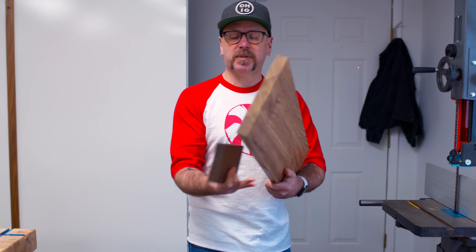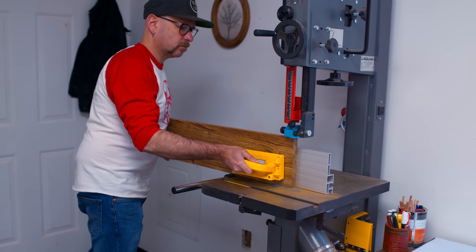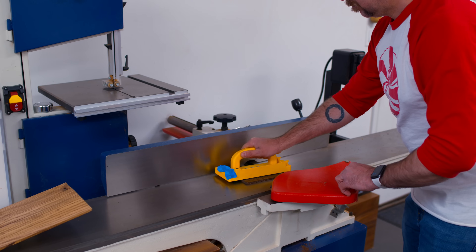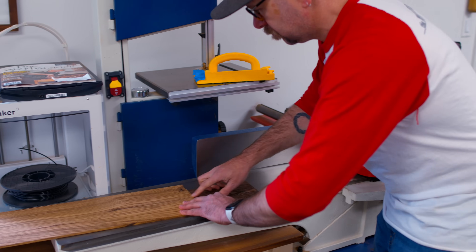I think this is wenge and that might work for the overlap. We are back from Kencraft with our zebra wood and wenge, and I'm just going to re-saw this into quarter inch thick pieces because we don't want to do an inlay that's an inch thick. The zebra wood was big enough to run through the planer to get a nice, even, flat, beautiful surface. The piece of wenge was too small, so I just ran it over the jointer until we got the same thickness. That's a nice looking table — it really doesn't need inlay, but it needs inlay.